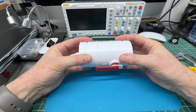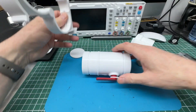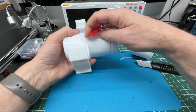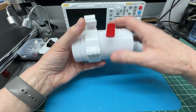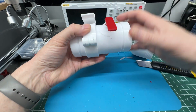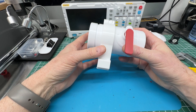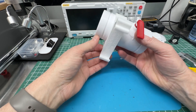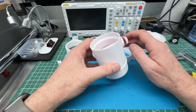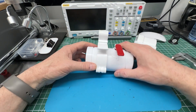To use this, fully assemble it with the ends — that puts the grooves on it that allow it to mate with the quick release head. You can also just use hose and hose clamps. The ridge here mates with the mounting bracket: set it down, and the valve is now locked in place by the mounting bracket. If you're building the full system, make sure to look at the original exhaust system posting and video for all instructions, parts, and part numbers.